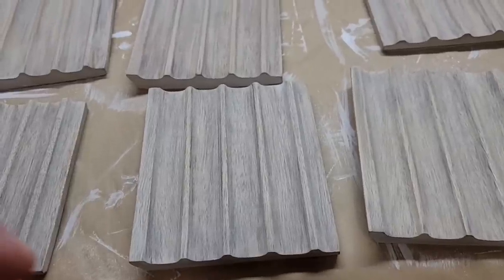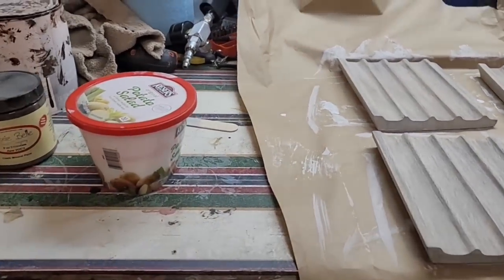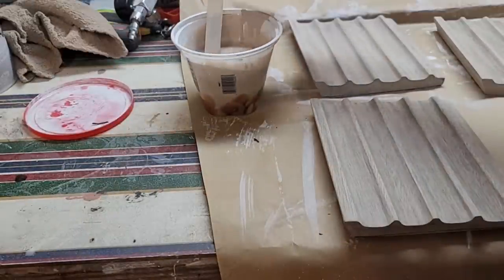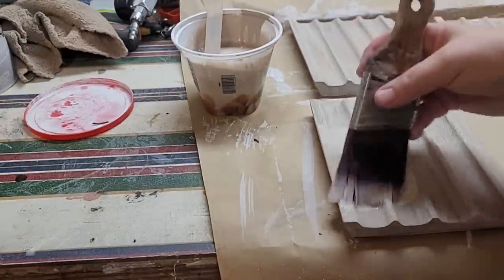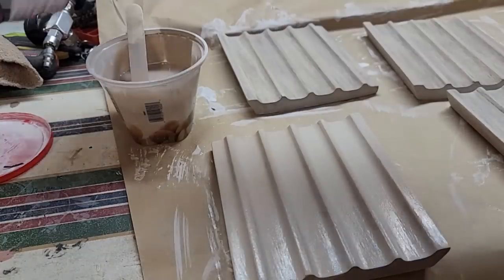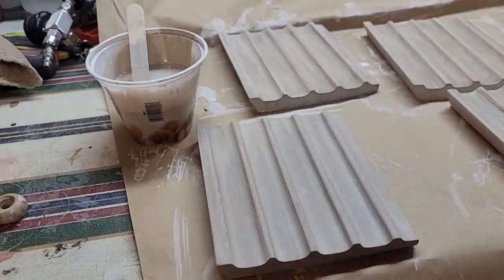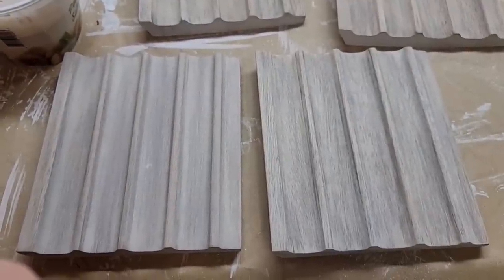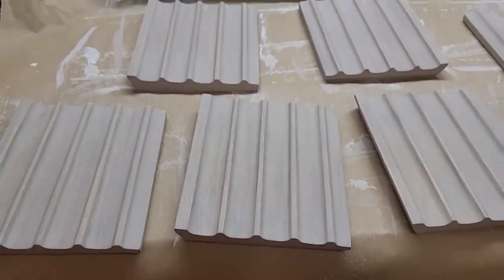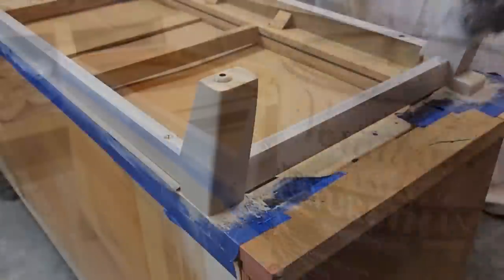These handles are beautiful and I'm really liking the more natural wood look, so I decide to do a beige wash instead of staining. This piece was so dark when it came to me, so I want to try to lighten it up a bit. I mixed up a custom beige in my workshop using a brown and a cream to make a light beige, then water it down 50% paint, 50% water. You put it on and then wipe it back, and it adds just a hint of difference. I end up doing two coats on the handles and also applied it to the base, then protected both with two coats of water-based polyurethane.